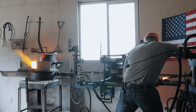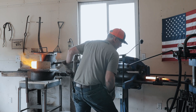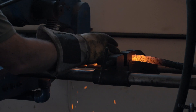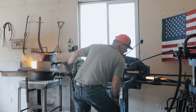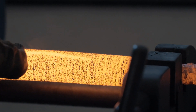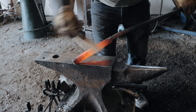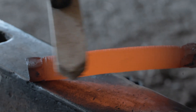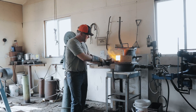We're doing our final twist here — got to get it mounted up, which is sometimes a fight. I'm twisting the same direction as before and just looking for any spot that looks like it might want to tear. It's twisting nice and really even — I'm going to call that good right there. I was looking for any crack but I got a really even twist from back to front. I love it. Cleaning this off and looking for any problem areas — it is just super clean, not a problem in the world. We're going to heat that up and press it down into a usable bar of steel for a blade.